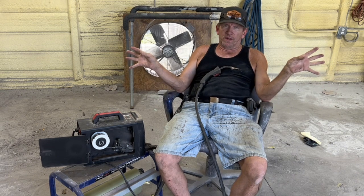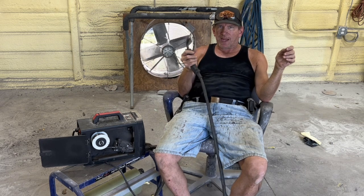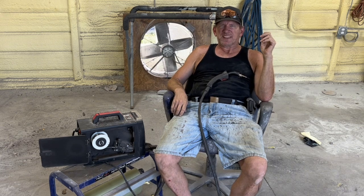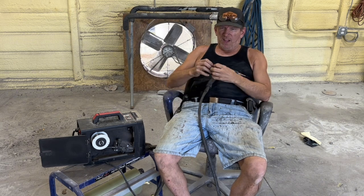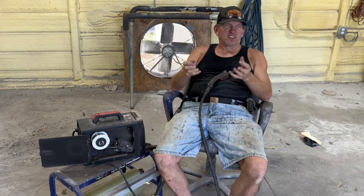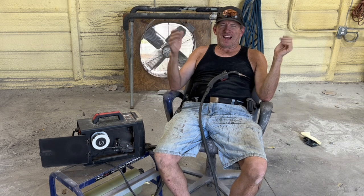That's why you can weld rusty metal with a flux core welder, and you can't with a MIG welder. You can, but it looks like some kind of cancerous mess when you try to weld rusty metal with a MIG welder. The weld erupts like Laffy Taffy or something, with holes, and just nasty. Looks like lava rock. Don't try to fool me. I've been doing it too long.